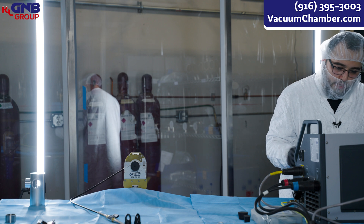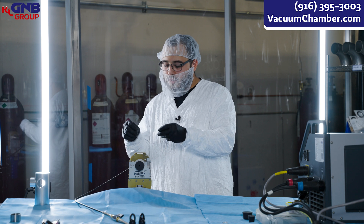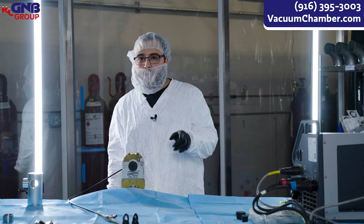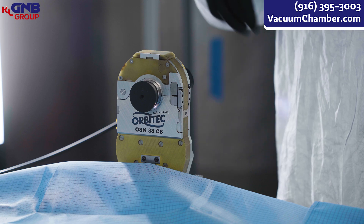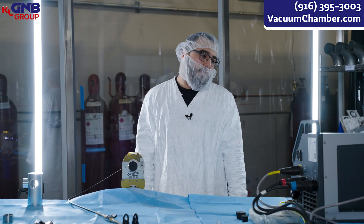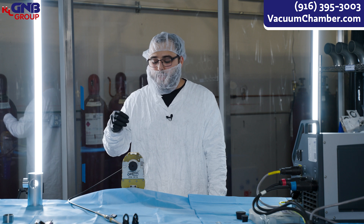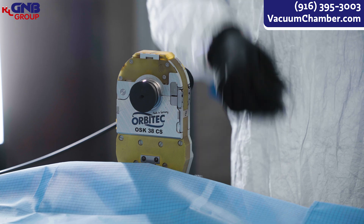I'm going to end up starting it right now. It's going to push a whole bunch of gas inside to make sure the part is fully enshrouded with all the gas it needs, and then it's going to start tacking around. It places eight tacks in different spots, and once it gets done with the eighth tack it'll go back and start to weld. At the beginning it'll have a travel delay, and then it'll start making that bead, and once that bead starts to form it'll start going around and fully penetrating all the way around.